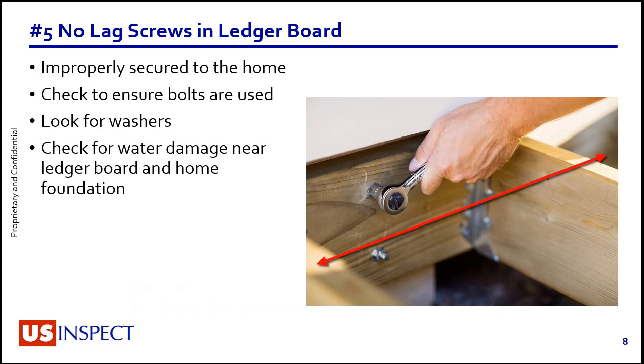The board running horizontally in the photo is the ledger board. If the deck is attached to the house, it needs a ledger board as this one has — bolting through to the structure of the home behind. The biggest issue with no lag screws is that if the deck is overweighted and only held on with nails, the nails can sag and get pulled out as the deck joists sag under the weight of people and whatever else is on the deck. Then grandma and the lit grill and everybody else goes rolling as the deck detaches and falls toward the ground.